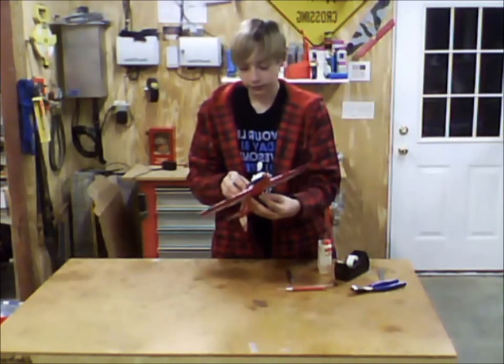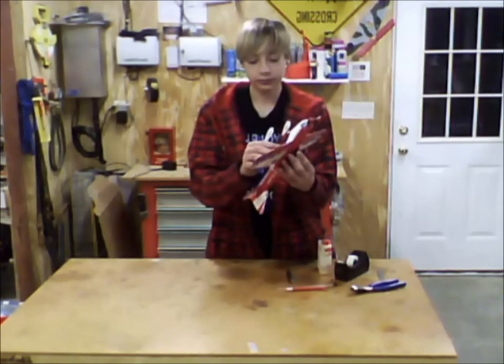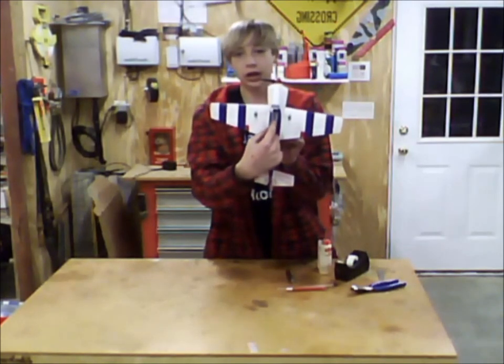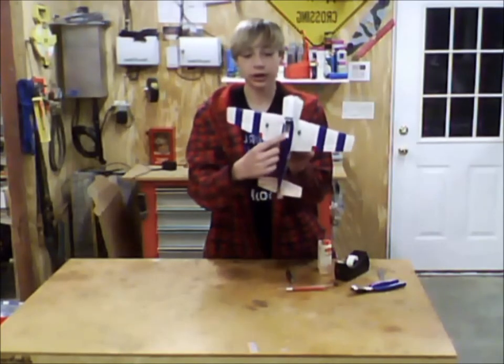I will show you what I did. When you do your CG, make sure you have your flight battery in the neutral position, because otherwise you won't be able to adjust it that well. Once I got it tuned in, I put a little black line right here under the battery so I know where to line it up every time.